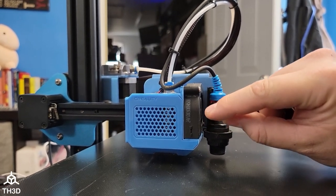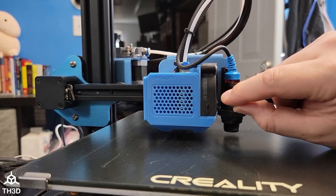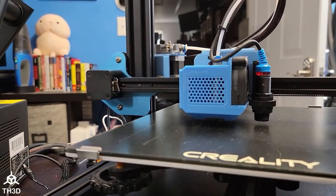So now the red LED is shut off. We want to slowly turn it back clockwise until the red LED turns on. So now the sensor light stays on when we move our hand away, and the sensor is now calibrated.